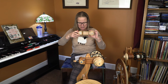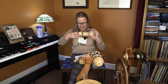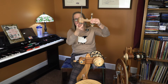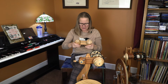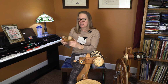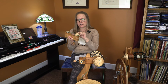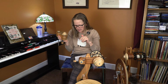So when I measured this idler groove, like I said, I measured the circumference and I came up with a diameter of a little bit more than 1 inch, which tracks. If you look at the distance from one end to the other, it's about 1 inch. So I feel pretty comfortable I had that correct. So what you have to do is get the ratio, because when the high-speed head is set up correctly, it has its own little drive band. I don't know if I told you about the parts yet, but I'll get to that, I think.